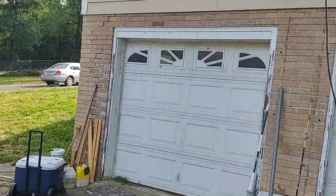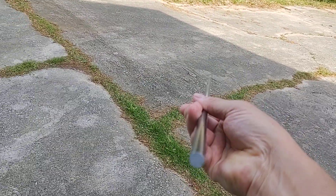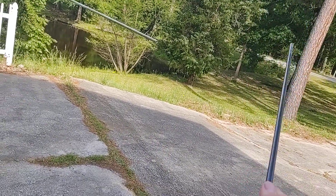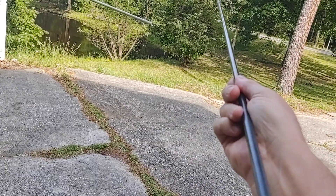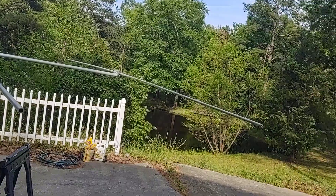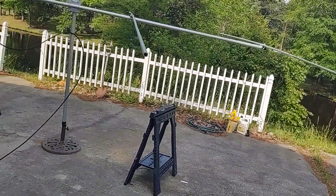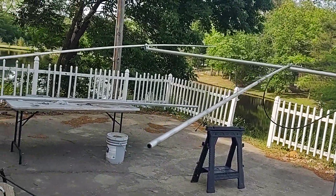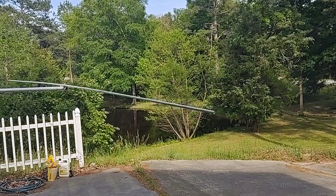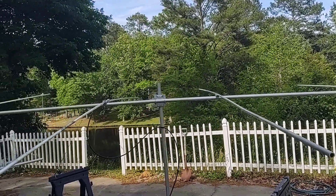My phone battery is getting a little low, but I also wanted to show you the fiberglass rod — this is a three-eighths inch rod here for reference, but we used half-inch. The one inside is about 43 inches of fiberglass. I did try adding end caps to the ends of the elements but that drove the SWR up a little bit, so I decided not to do that.